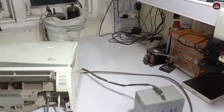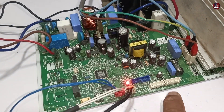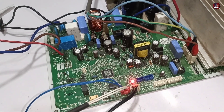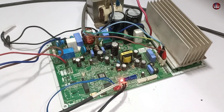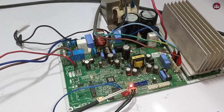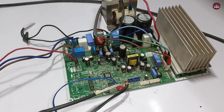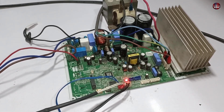Let's check what problem it is showing. The motherboard has started to blink. The DC fan blower motor is not installed with the motherboard, and the motherboard is showing a DC fan blower motor error. I don't have the DC fan blower motor for this motherboard. This means the motherboard was not dead. You saw what the issues were and how I fixed them — I don't know why the other repairman rejected this, but I have successfully fixed this LG outdoor motherboard.